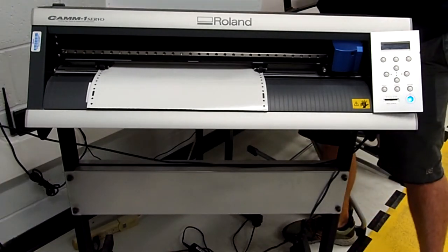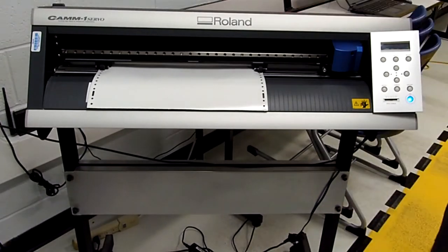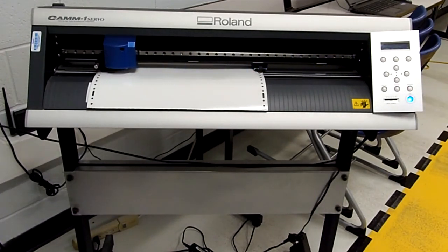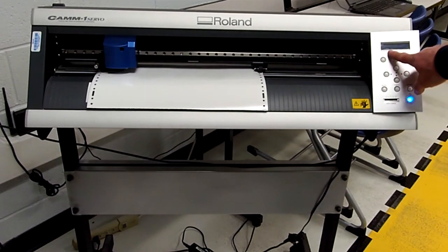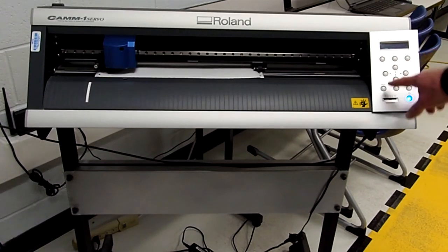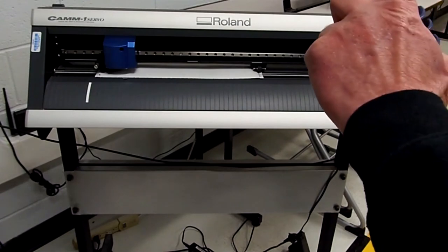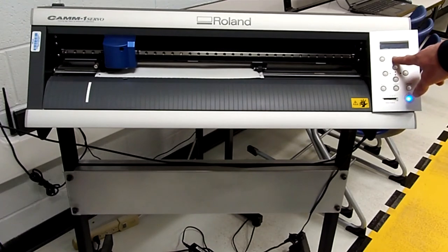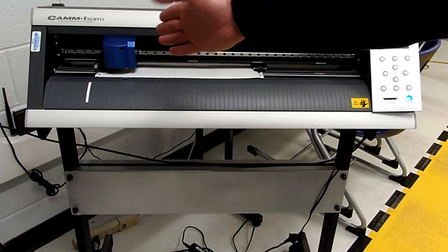This roll on the back side is just this big roll of white sticker vinyl. So at this point where it says roll, the first thing to do is go ahead and hit Enter, and what it's going to do is use a little magic eye that measures and tells you how wide this roll is — we can go up to 24 inches on this one. This is really important: on the screen you'll notice it has the width and it says it has measured 14.0 inches. That's a really important number because we are going to input that into our software. Now we need to press and hold the up arrow and that gets it to the bottom-left corner — we're going to call that our zero-zero, just think of the Cartesian coordinate system. That is the very bottom-left side of our material; we'll call it our origin. We're going to press and hold Origin here until it stops blinking and we set that to the origin.